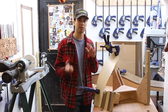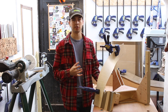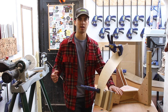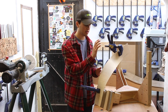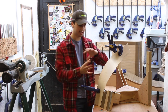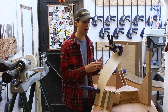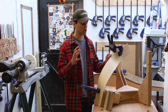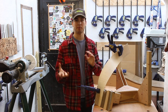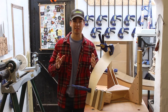I wanted to do this method to show you that if you didn't have a vacuum bag you still can do bent lamination — there are other ways to do this, but this is the way I'm going to do it for this project, to show you it can be done with just two-by-fours and some clamps. Now I think the rails are going to be eight layers thick. The more layers you add the harder it is going to be to bend into position, so what I think I'm going to have to do is glue it up in stages — first gluing up three layers together, then adding layers on each day or each couple of hours depending on how fast it sets. But that will be clearer when we get to that stage.